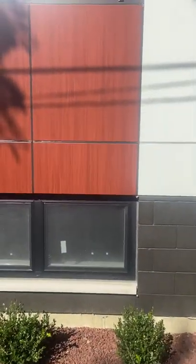Half a day later, after I shot that earlier video, I was working on my black sheet metal panels and I looked at the wall that I did — I was ready to cry. The thing is, guys: never do caulking on the panels when you know it's going to be a hot day. When dark aluminum panels expand on a hot day it's really dramatic — even one-eighth of an inch is enough to screw up the caulking. So if you have dark panels, don't do caulking if you know it's going to be a hot day.